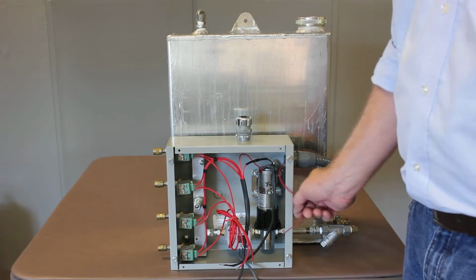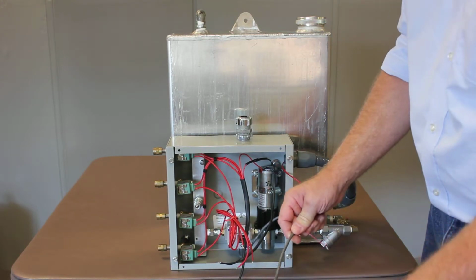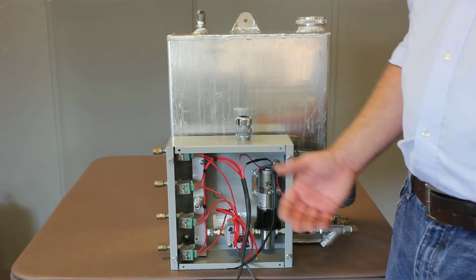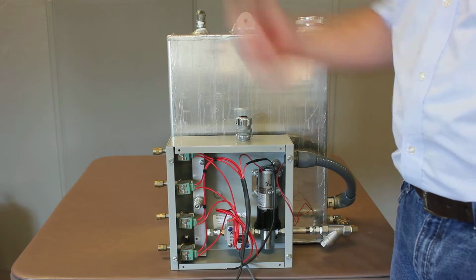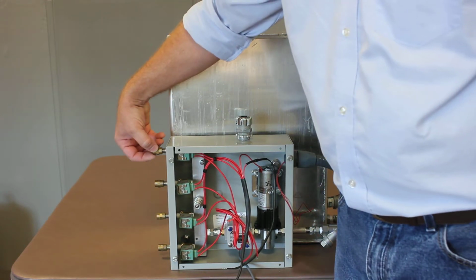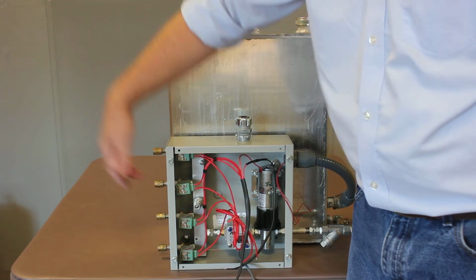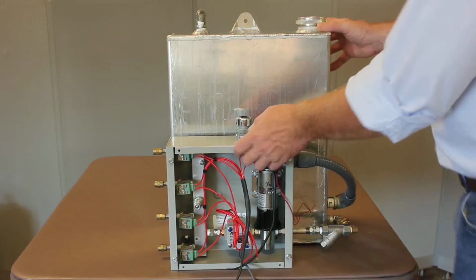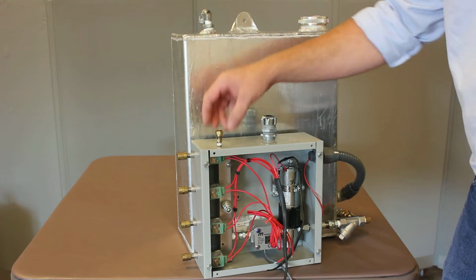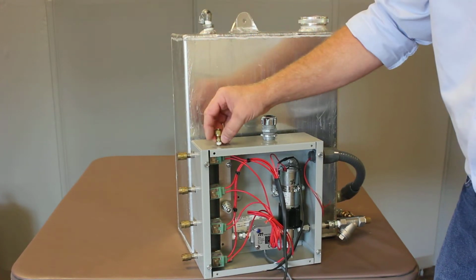So that takes care of your float switch has been landed, your additive meter has been landed, all of your valves and your motor have been landed. The only remaining thing is the fluid path, which again the suction's taken care of. So you're going to have to get a tube from here to compartment 1 and here to compartment 2 and so forth. Now we have sent you fittings for that, straight fittings. We sent you some 90s as well. We're not sure what you want to use.